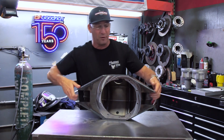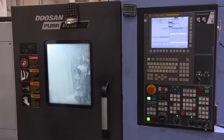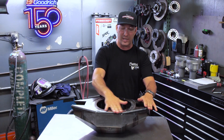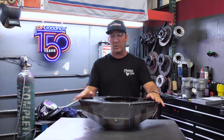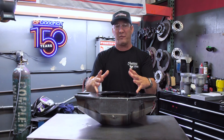You can see the shiny surface here. This sits on its back, gets flattened out, we chuck it up in the machine so it's held firm, and then we have a giant fly cutter that cuts this and makes this surface perfectly flat. The next thing we do — which is the most important part — it then drills and taps all the holes on a perfect pattern.